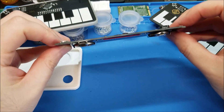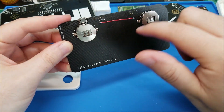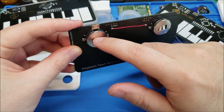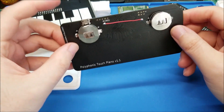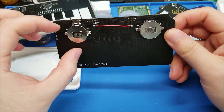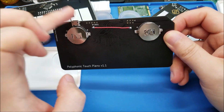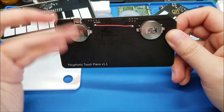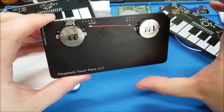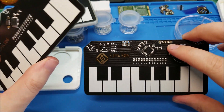The other thing you may have noticed is there is now a USB port. It probably would have been best to put a diode before the battery so that if you plug in USB while batteries are inserted it won't try to charge them — which is not good if they're not rechargeable, and there's no current limiting either. Basically the idea is: you either solder the batteries and don't solder the USB port, or solder the USB port and don't solder the batteries — use one or the other. Another improvement is I have debug headers on the front.